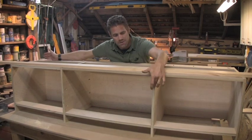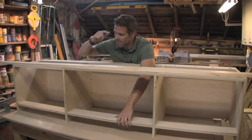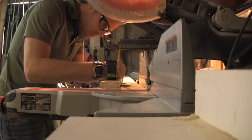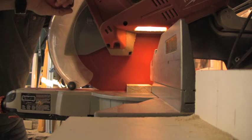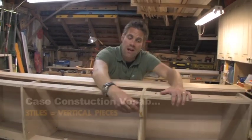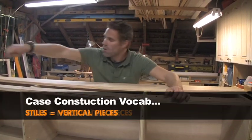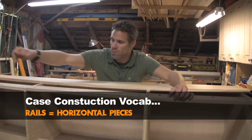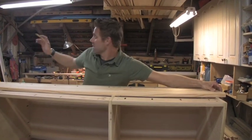Cut your 1x4 to exactly the dimension of your box, which for me is 74 and a half inches. Cut your stiles at 13 inches. Then head to the miter saw and make two cuts at 74 and a half inches — the length of our box. Those two pieces will be your top rail and your bottom rail. The stiles would normally run all the way to the top, but this layout makes it more efficient: one long rail on top, one on the bottom, and then four stiles.